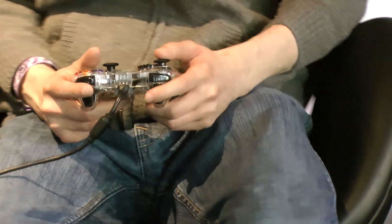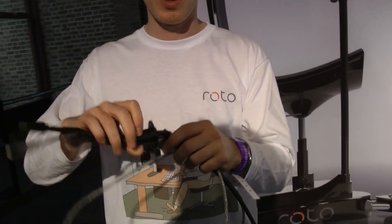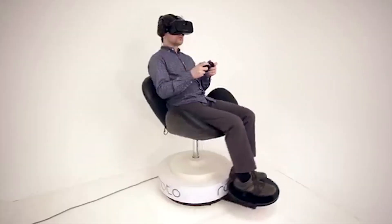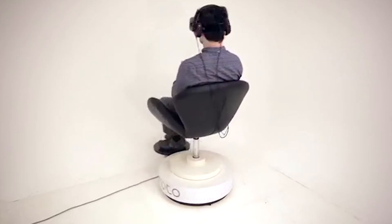For example, how do you turn around if you've got cables attached to your head? When you start to move, the experience is jarring when you can feel the cable touching you as you move around. And if you turn around more than 180 degrees, you start getting tangled in the cable. So we've designed a slip ring solution which allows you to turn around infinitely in either direction, up to two and a half thousand RPM.